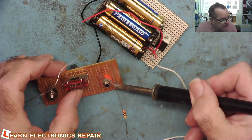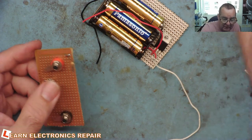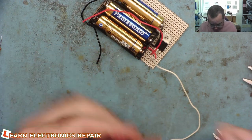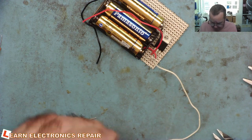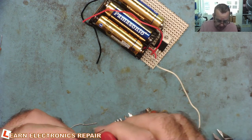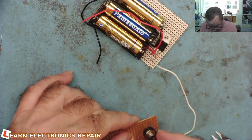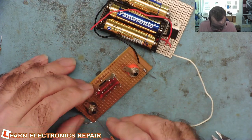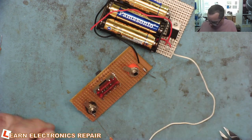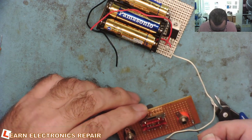The easiest way to mount the front panel is to put some stiff wires through a few of the holes and solder them down. I'll use the legs off some 22 ohm resistors — I've got hundreds of these from amateur radio years ago, they serve lots of purposes either as resistors or stiff bits of wire. They're ideal for this. I'll sacrifice one or two for this purpose. We bend them down, fit them into the holes, and solder them back to hold the panel on — these are just physical mounting points, not electrical connections.